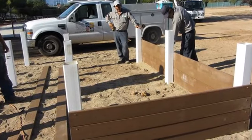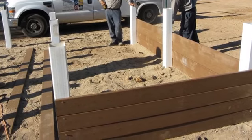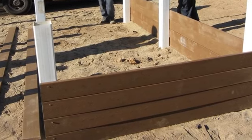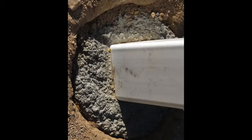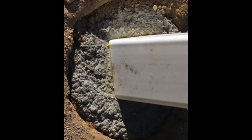I've got some examples here — photos from a shoot of a design I'm working on right now. You can see where they're building some pretty sizable planters, and these are being done so they'll really last. The fence posts, which are the white vinyl that you see, are the same as white vinyl fence posts you see all around. It may go with picket fence or ranch fences. You can fill it with concrete and then put your Trex board up where you'd put wood. This makes a really secure, strong structure. You can put footings in cement to keep it really strong.